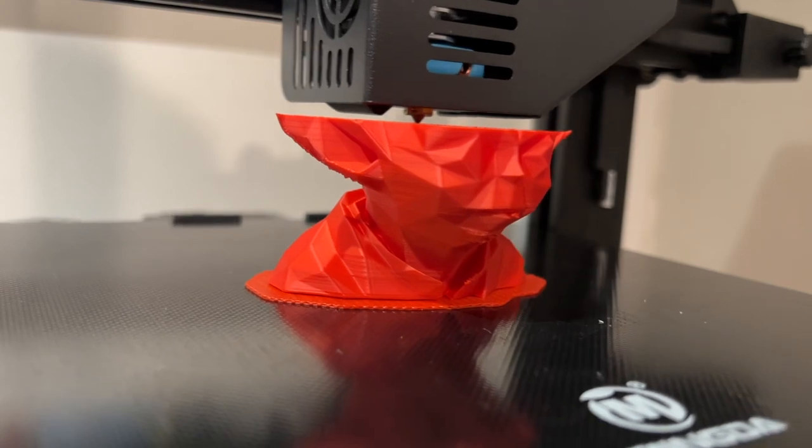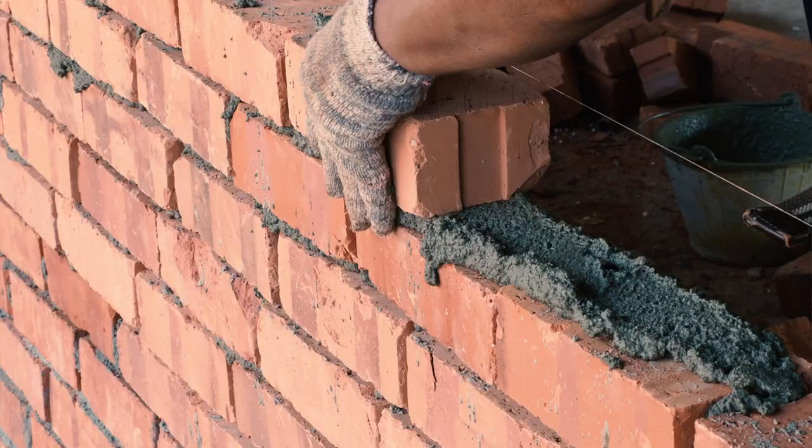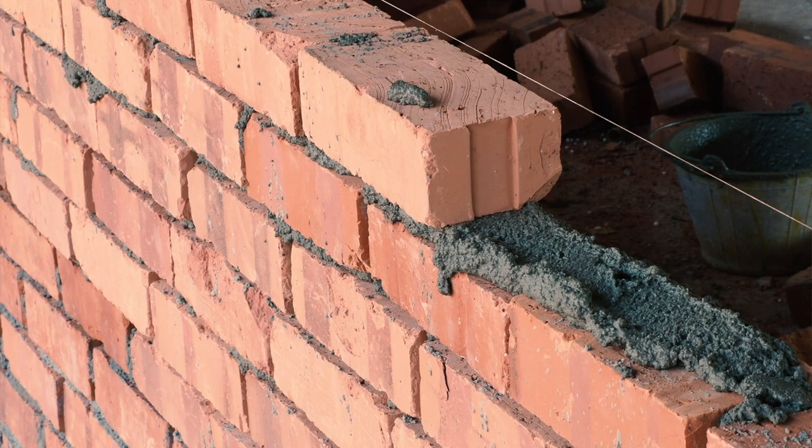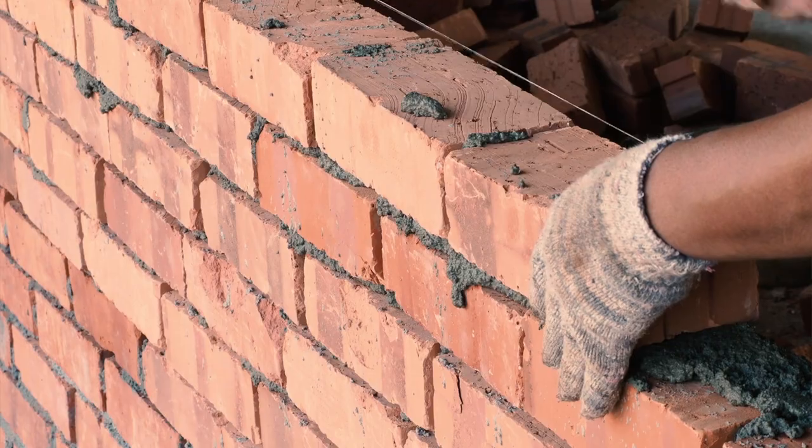And here's where the complication comes in. As you may know, 3D printers work by printing layers of material and building them up. You can think of an image in your mind's eye of a brick house. Now, even if you put the bricks right on top of each other, the layers right on top of each other, there are small gaps potentially between the layers. Think of the mortar between bricks. And those small gaps can trap food particles and even can trap bacteria or other nasty stuff.